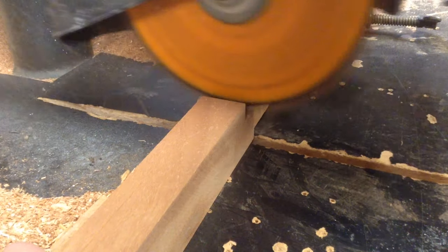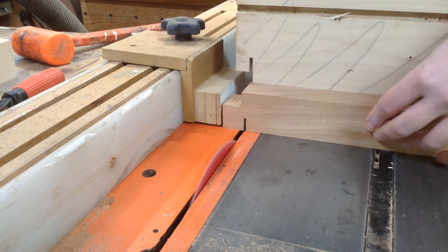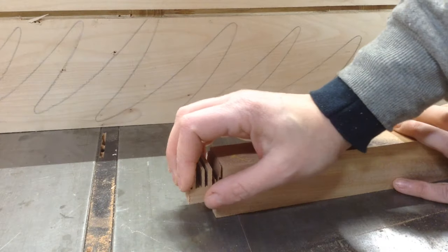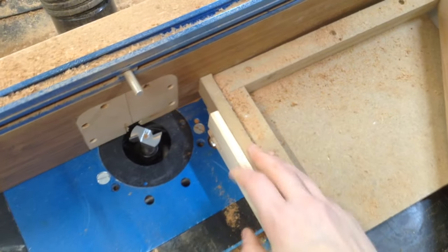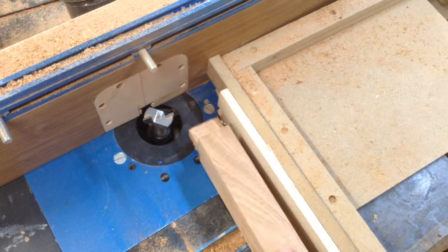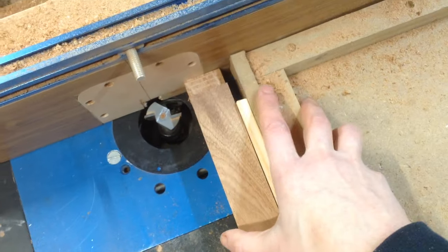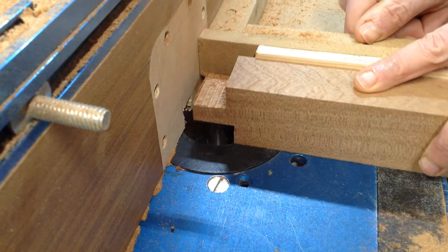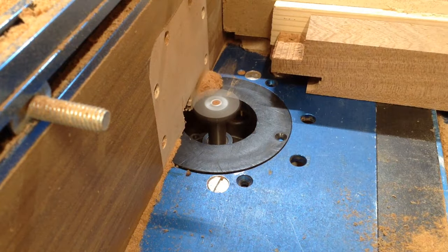I was pretty certain everything was off by about a quarter inch. I cut down all of those pieces and all of the setup stayed the same — that was perfect, it was just my pieces were too long. On the radial arm saw I was cutting the part for the rabbet. On the table saw I remove the material that will start the cope — you can cut the whole cope on the router table, but I find it sometimes bogs down the bits, so I remove the bulk of the material first. I have a right-angle sled for the router table which makes this a much safer cut. The fence is set for the correct depth, the router bit is raised to the right height, and with three passes I can create that coped edge. All of this was a little bit of trial and error.